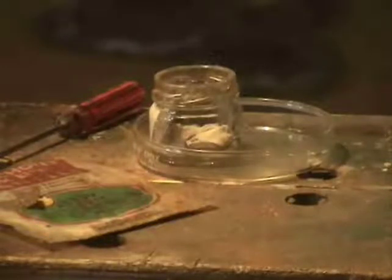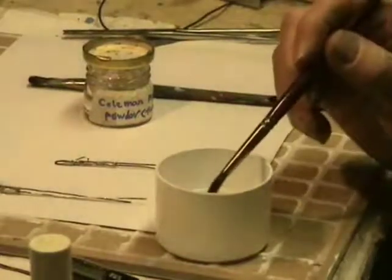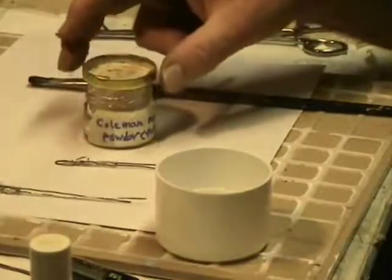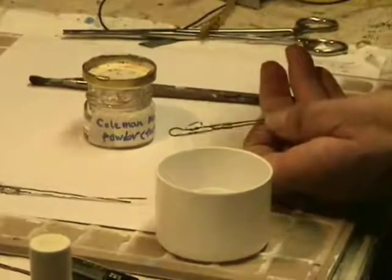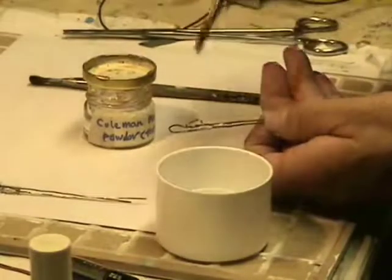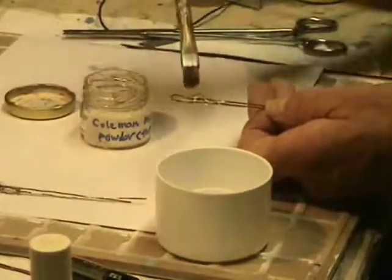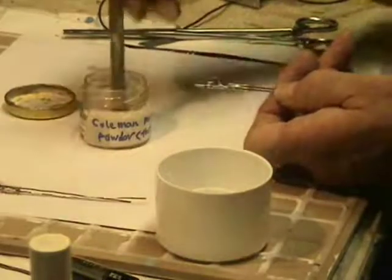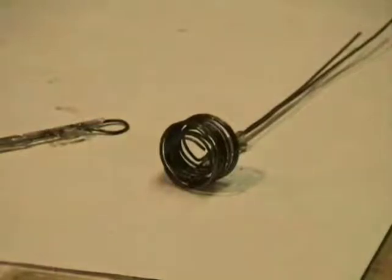The Coleman mantle burns and turns quite black at first. When used in Coleman lanterns they ultimately turn white, and this one is turning white as the residual burning takes place. I'll let it go completely white and stick it in my petri dish. I have my little jar of the leftover debris from the burnt Coleman mantle — I'll put a ball bearing in the jar and shake it to pulverize it. Here I have my thinned-down nitrocellulose lacquer and my Coleman lantern mantle powder, and I'm going to put some lacquer on the filament and quickly apply some of this powder.